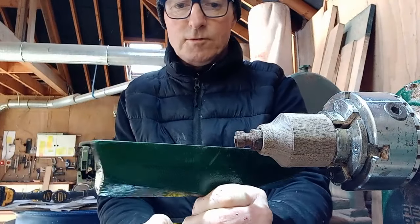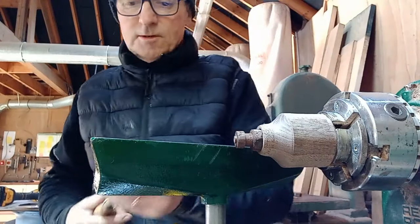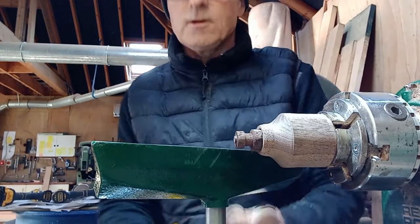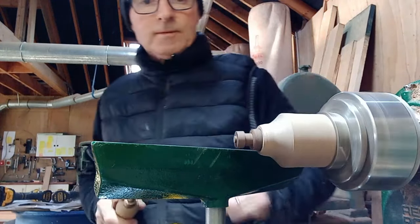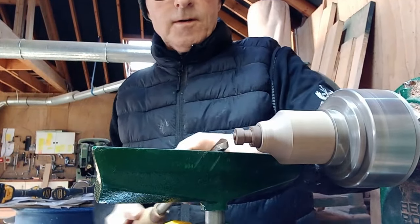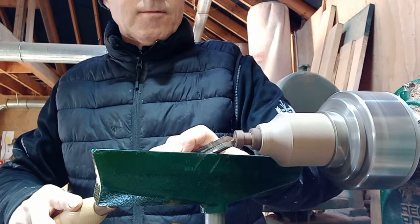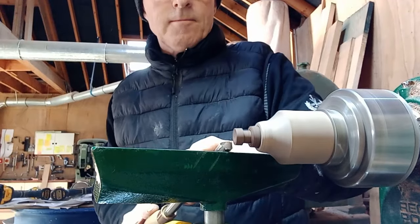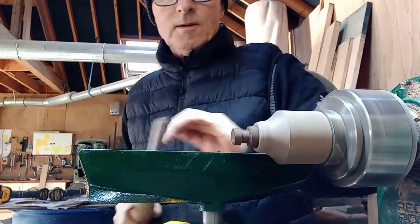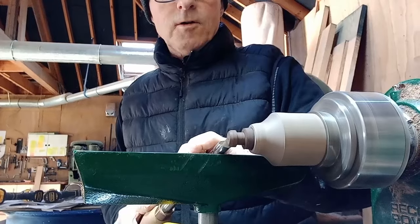So I'm just going to use my 1/2 inch gouge on that. Now, this is a bowl gouge I'm using here. I just tend to like the bowl gouges even when I'm doing small work. Everybody does their own thing. It's a little bit high there with the tool rest. So in this case, just take off that little snitch there. Now just straighten this a small bit more. It'd be better if it was straight, but this is so small, not going to make a big deal.